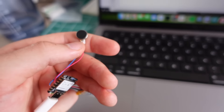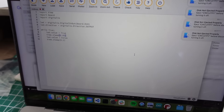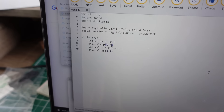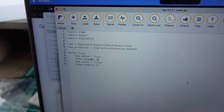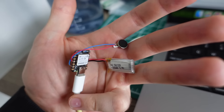You might think that's pretty obvious and you can probably hear it. Here's a cool thing: if I just change this number from 0.5 to 0.05, you can barely feel it, you definitely can't hear it, but you can still feel it. And you can tune this — 0.05 is a little too faint, but 0.1? Now that feels good. The next thing I'm going to do is write a script that taps into the Bluetooth low energy on this chip so I can communicate with it and turn this buzzer on and off via Bluetooth — proof of concept.